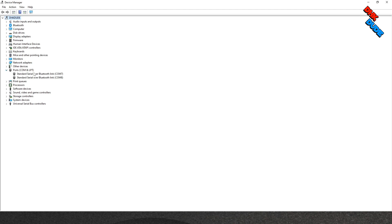Connect the setup to the PC and open the device monitor. Open the device manager to find the COM port allocated to the controller. Port number 6 is allocated to our controller. If you look closely, this controller has a CH340 chip to communicate with the PC.